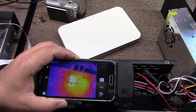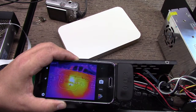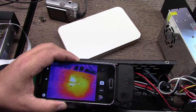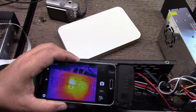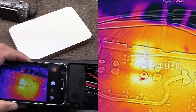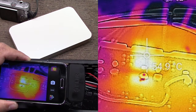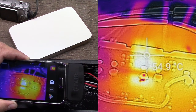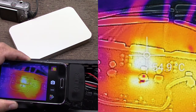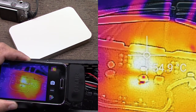So we're back, and I've told it to heat the bed up to 90 degrees C, because one of the things I was seeing in the notes is that 80 degrees C is where this issue was happening. Now typically I only print PLA and I only operate around 60°C on the bed. But as you can see on the FLIR — and I'll do an overlay — the whole circuit by the heated bed lights up like a Christmas tree. Right now it's at about room temperature around 20–23°C over there, and the bed area is at about 56–58°C and climbing.